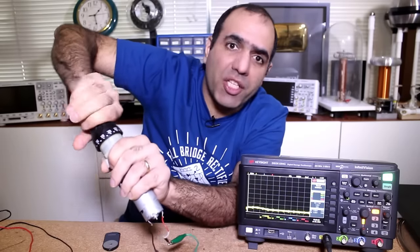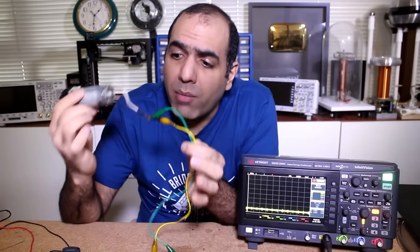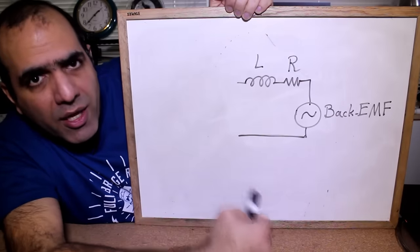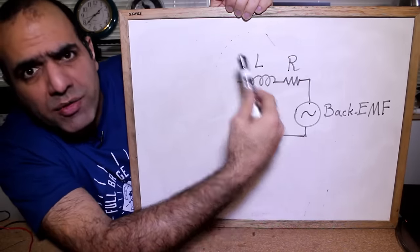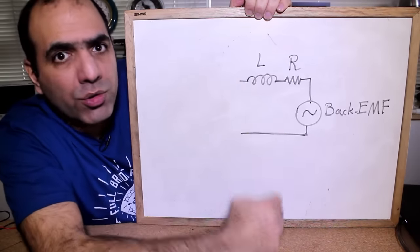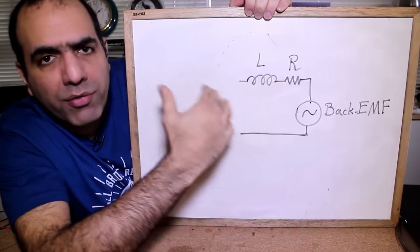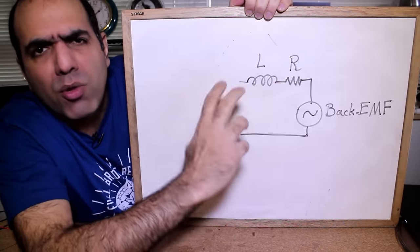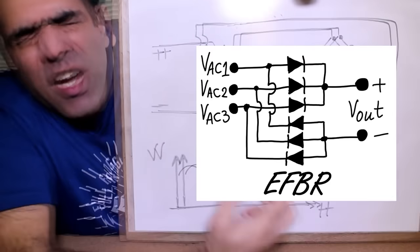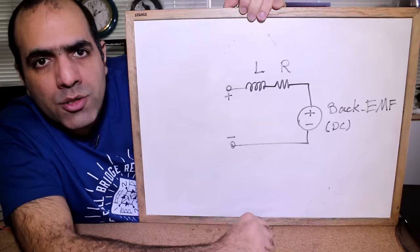A motor with permanent magnets acts as a generator, outputting a bumpy voltage. But even when we run it from a power supply the generation action still happens and creates electromotive force — a voltage that comes back from the motor that we call back EMF. A simplified model of the motor winding looks like this: the inductance of the winding in series with the resistance of the wires, in series with an AC source for back EMF. This regenerative voltage source exists on all the windings of the rotor, and its voltage is dependent on the speed of the motor, starting from zero when the motor is not turning. The back EMF sources of different windings get rectified through the commutator, similar to a three-phase full bridge rectifier, and create a bumpy DC source.